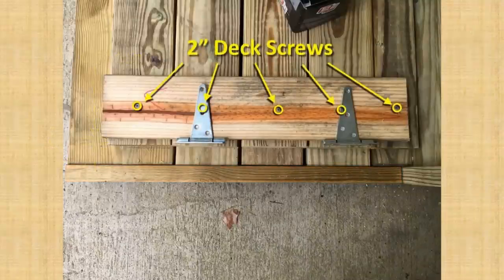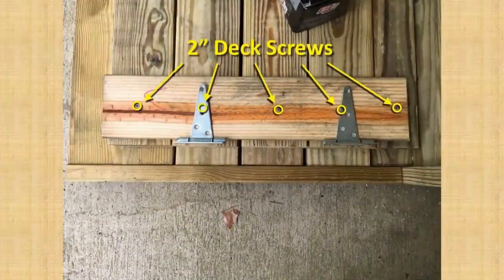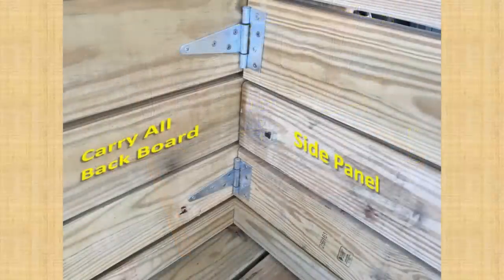Initially, I used only one 2-inch deck screw to attach each of the deck boards to the side panels, with screws roughly in the center of the boards. This allowed me to verify good alignment when opening and closing the side panels before adding more screws to make it rigid. Note that the latches must be mounted high enough to clear the platform side boards. Here's how I mounted the hinges — which is backward from what I intended, but it works. The long hinge flanges were supposed to attach to the side panels. I attached the hinges with the carry-all lying on its back, putting just one screw in each flange while testing opening and closing. Once I was sure they worked properly, I put in the rest of the screws and tightened them up.